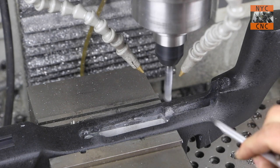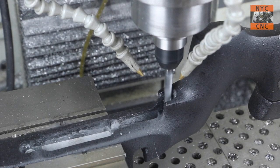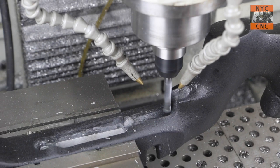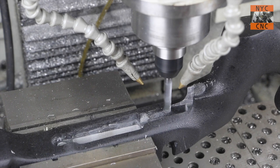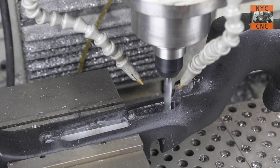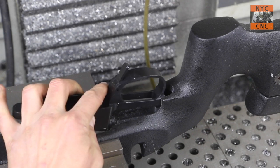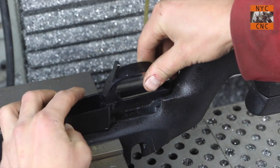Now I know this is going to be a little bit too high because we're still working off of the z-height of this lug over here, so we'll probably have to come in and take another pass. That did just scare me - I meant for it to start over here. We'll probably have to come in and take another deeper pass to relieve this wall right here. But this will at least tell us if we've got a good width. Good news so far - check that out, just nice and snug. It fits! It fits but doesn't have any looseness to it, and I can see it'll ride that channel as well. That's starting to look like good news.